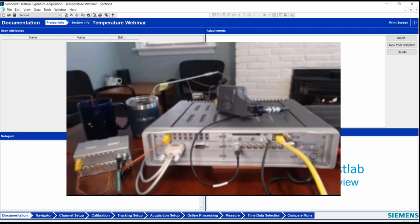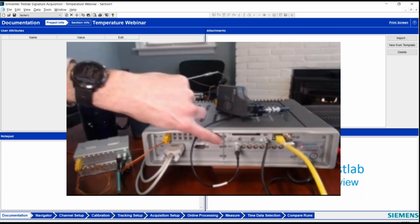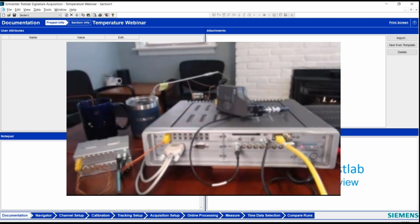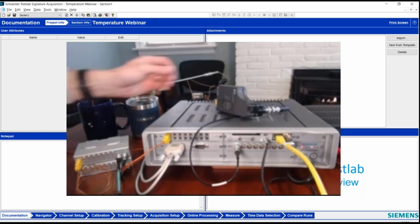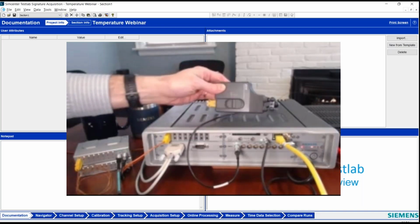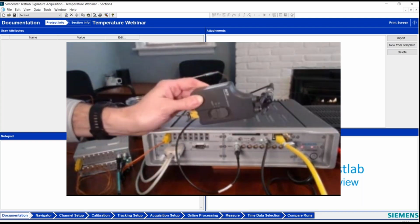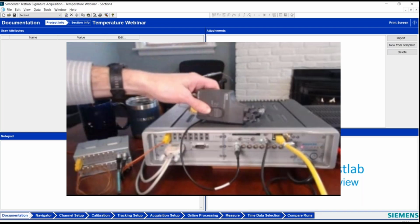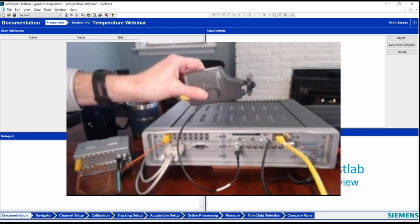And then lastly, I talked about the possibility of using a DC input or just a regular channel input. So I've down here got, in this case, a VB8-2 card. It could be a V8, a VD8. Nearly all of our modules, like I said, can measure DC voltage. But in this case, what I'm using is this little external signal conditioner, which lets me plug in one thermocouple. I set the switch to either Fahrenheit or Celsius. It just scales the output.